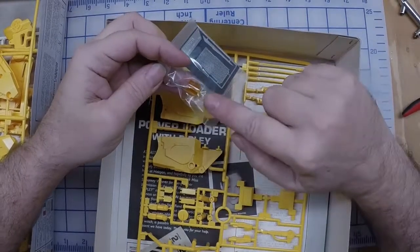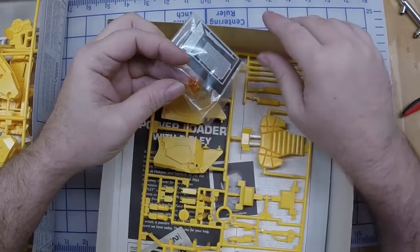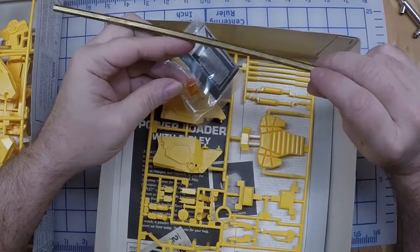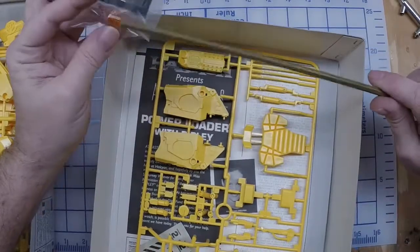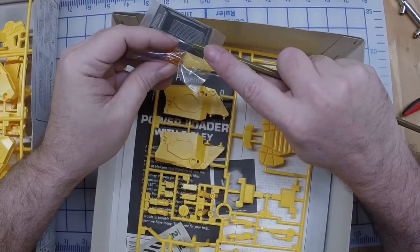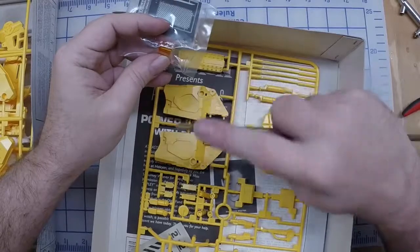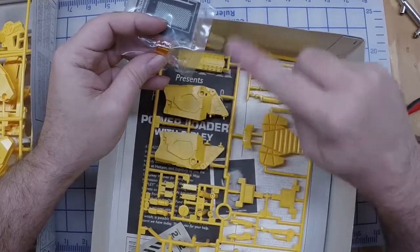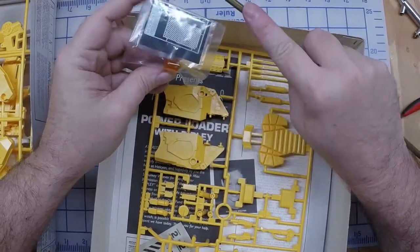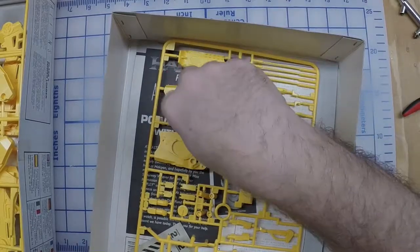We've got a nice lens for the rotating beacon on top. What I'm going to do there is use probably six LEDs. I'm going to use a piece of hex brass and solder a surface mount LED on each side, cut a small piece and put it up in there. That'll be controlled by an Arduino or maybe even a PIC microprocessor — I've got both. The lights will come on and off in a sequence so it looks like it's going around and around, which should be pretty cool.